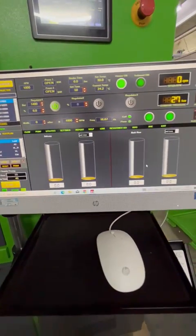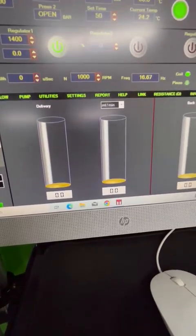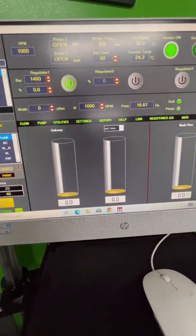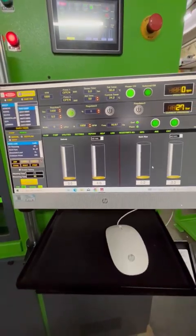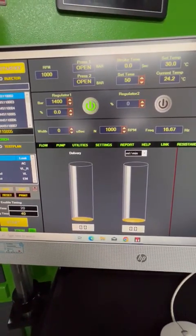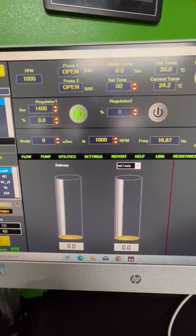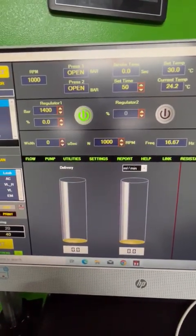The simulator comes inbuilt with digital flow meters for recording the output delivery and return flows digitally. These flows are recorded and can be saved on the test report in PDF form and printed out as well. All kinds of DRVs are supported. The upper part of the interface shows the RPM test band speed, and the second part shows the pump settings, which include the pressure settings and DRV settings.